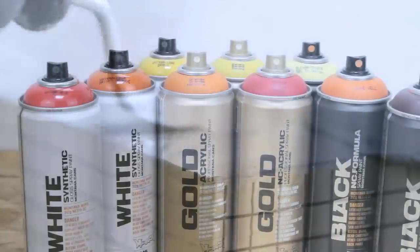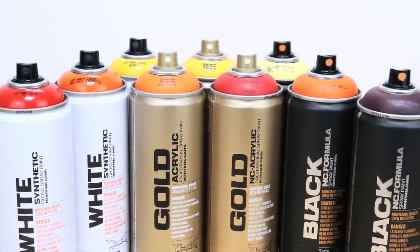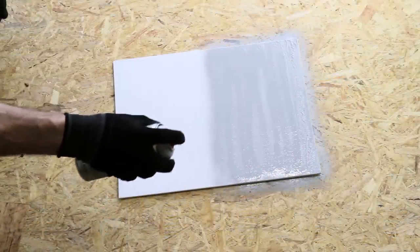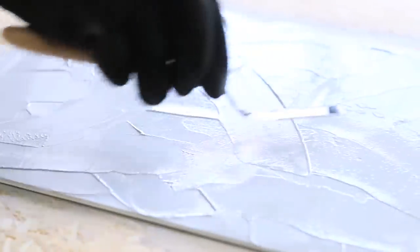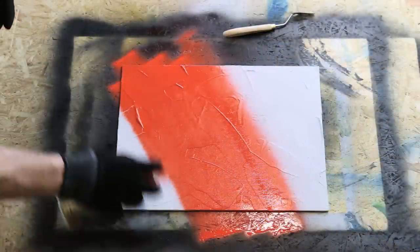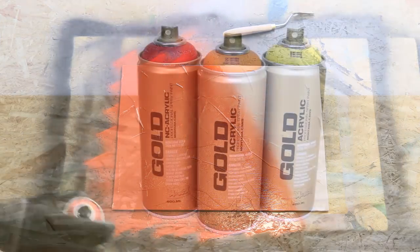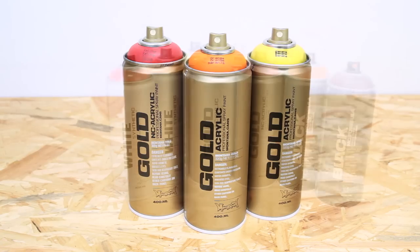After thoroughly dry and cured, Texture Spray can be top coated with many common lacquer types. The Texture Spray has good adherence and is highly water resistant. It offers also a high layering and thick filling capacity due to excellent paint stability. Sandable already after 2-3 hours.